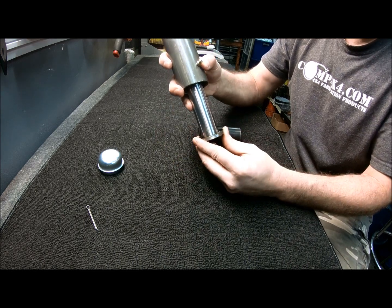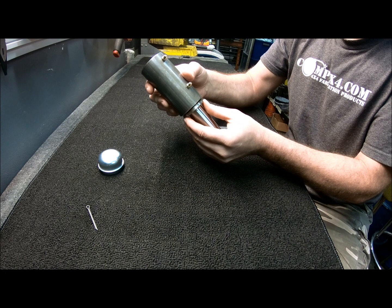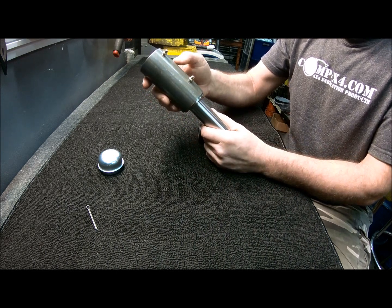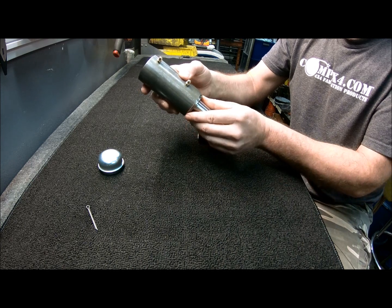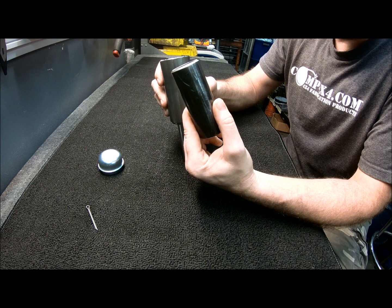For the bottom, sealing duties are handled by a one-inch double lip grease seal. After welding, you don't want to put that in before you weld — after you weld, you'll install that, and before greasing, press it up into the housing.